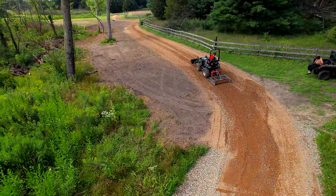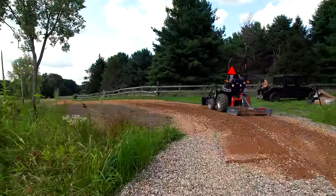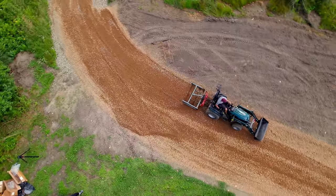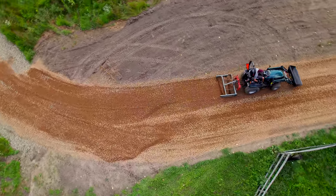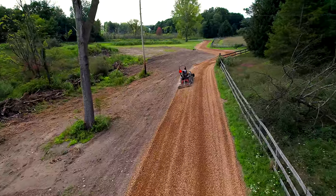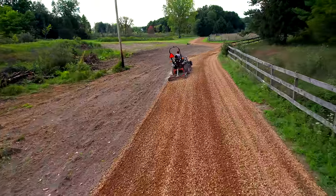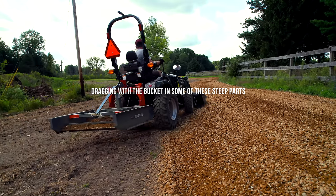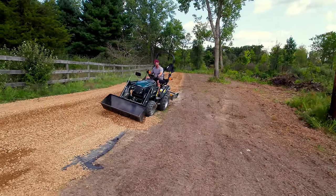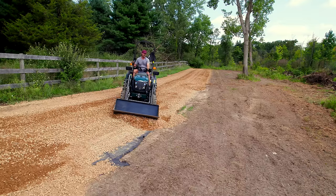Now, Tom with Balkama is really good at his job, and if you can have a good operator that can tailgate like he can, then it's gonna make your life a lot easier. If you can at all avoid having a pile of stone dropped just in a big heap so that you have to spread it out, you're gonna save maybe hours of time depending on the size of equipment that you have to move it around. And Tom is just, you can tell that's what he does day in and day out. He's been doing it for years, and there's a little hump here or there where the run just starts or the run just ends, that kind of thing, and that's about it. Other than that, he does 90% of the work, and running a land plane behind it, you just kind of drop it down and go.